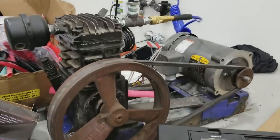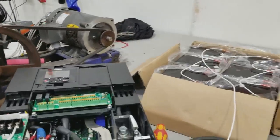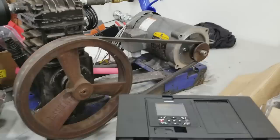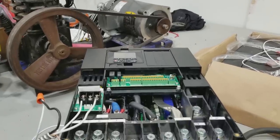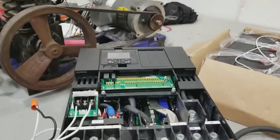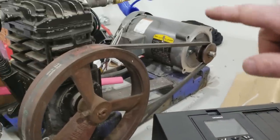We're gonna pressurize it with this little dude out here, running off batteries into a variable frequency drive, three phase. What the fuck for? Because we can, one. And two, if you're off the grid and you wanna run a three phase motor. Dewclaw programmed her for 90 hertz, so she ought to chooch quite a bit faster.